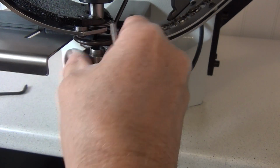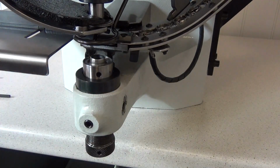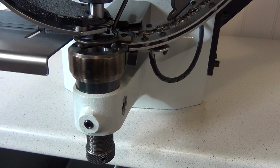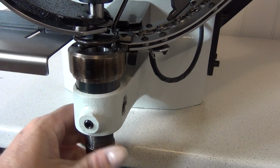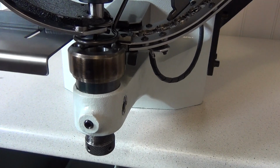Reversing what we just did will leave us with our bottom die back in place and its holder moved down away from the punch in position. This is where we move on to setting the cutting position of the bottom die. With the bottom die holder all the way down, the bottom die won't even be close to a position where it will cut material. So begin by looking at the threads on the holder and moving the holder up enough to show about half of those threads.